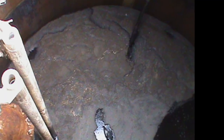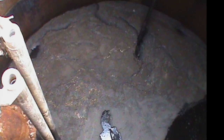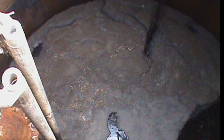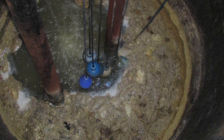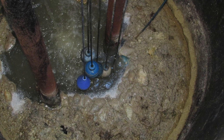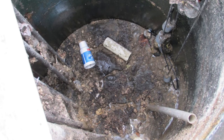While H2S is caused by a combination of the waste materials entering the collection system and the waste products of the microbial population in the wet well water, fog is commonly the first problem that must be resolved. Fog caps form because of the fats, oils, and grease that enter the system, primarily from the gray water entering the system from residential and public eating establishments.